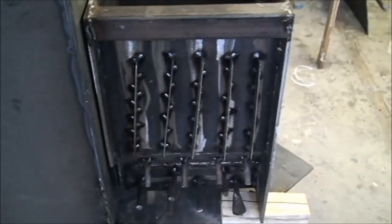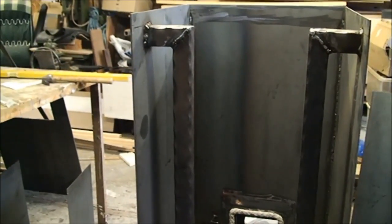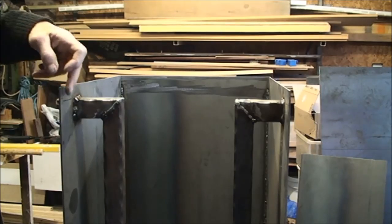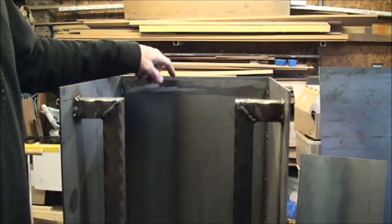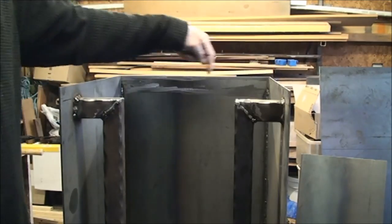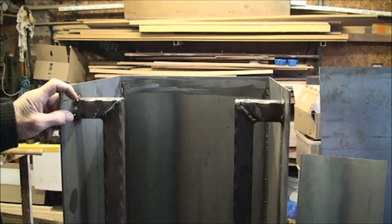It's all looking like it's nearly there. I need to weld some angle iron around the top of the exchanger. I'm going to put my heat rope on top of that, then drill through the 6mm top and bolt the top down, compressing that heat-resistant rope where that gap is.